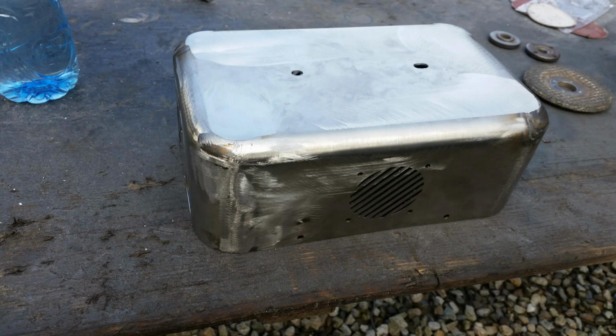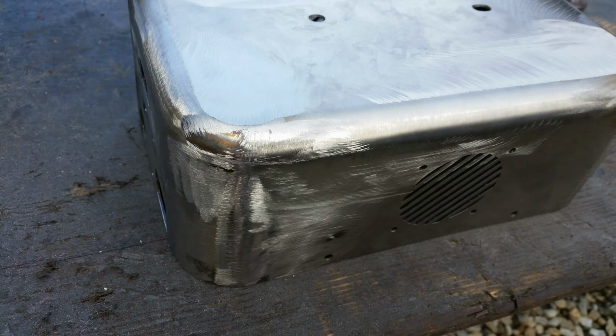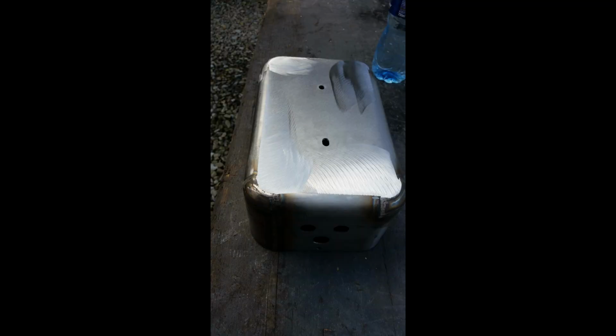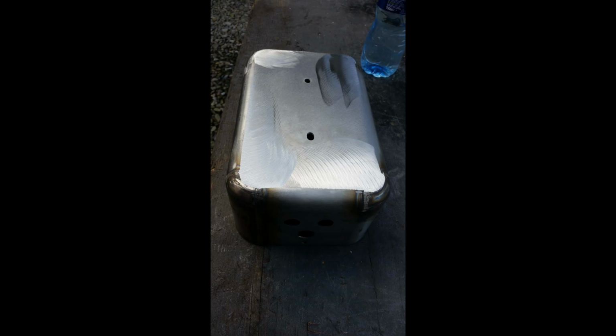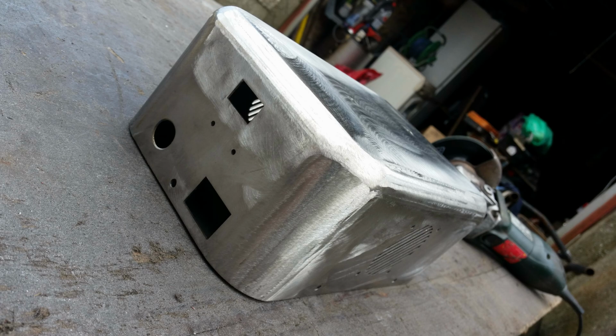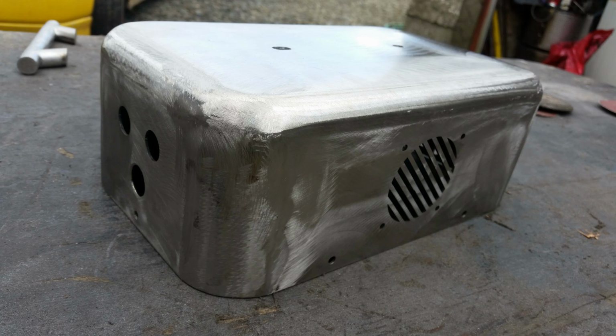This is the box, starting to be ground or flattened using sanding discs for the grinder. Flat discs, making sure I don't put... no, there it is there. So that's sanding, grinder dust on that. With like a sanding, I forget what you call them now. You might see them in the photos here, they're a flat disc with rubber back on the grinder. So this is it ready for DA sanding, to take out all the marks.